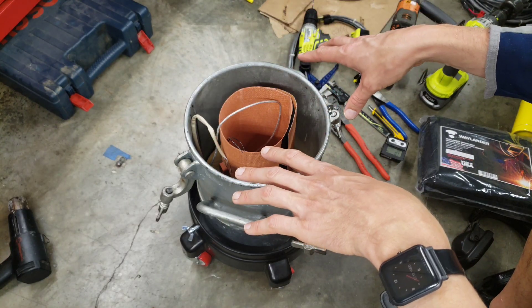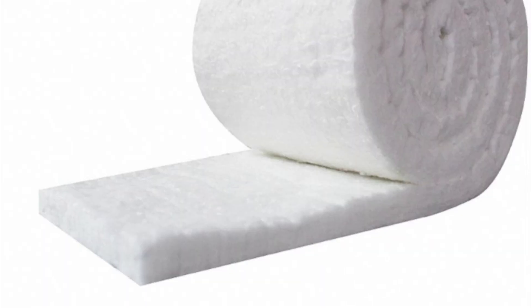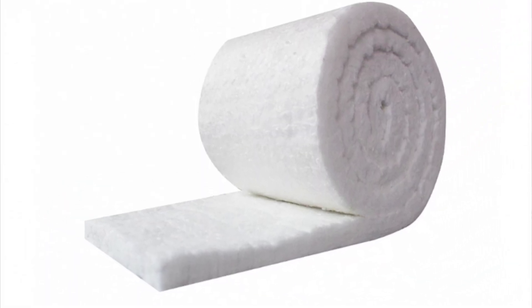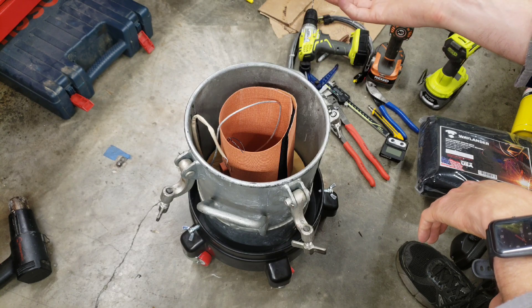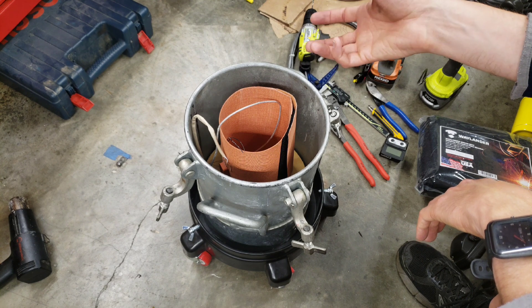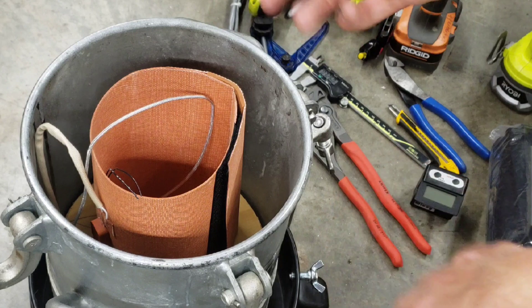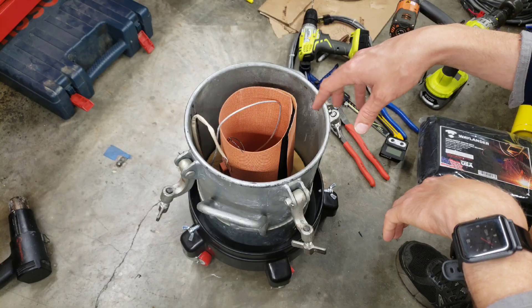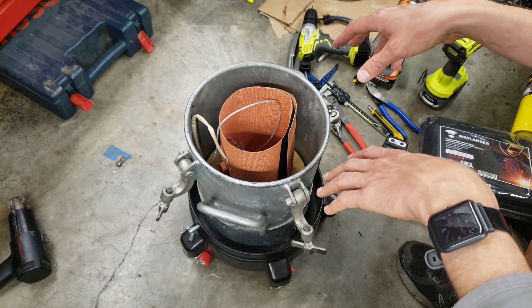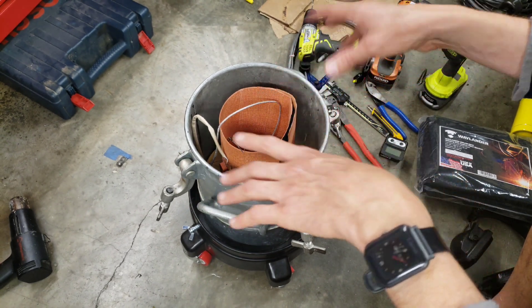Now I need to insulate this. One of the options I was looking at was ceramic insulation, like kiln insulation, which has a very high temperature rating — though that's not that important here. The problem is that it's fragile and you're not really supposed to handle it that much or touch it. It can make dust. It comes in blanket form, like a fabric, but you're supposed to encapsulate it if you're going to be exposed to it.